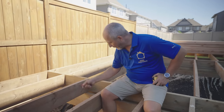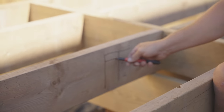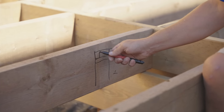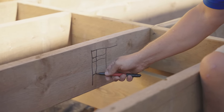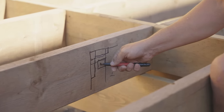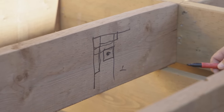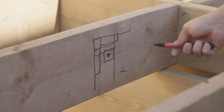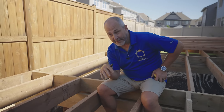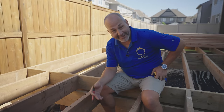So I'm going to show you the plan for the deck. Here's the corner — this is the box beam and here's our floor joist. When we're finished putting all of our boards on, I'm going to have an inside table here. I'm going to build in a custom eight-foot sofa on each side, and then we're putting a fire pit right here. My goal is to identify where this location is because I want to have my gas line come underneath the deck and come out of the deck right here. My gas guy said you need conduit, and inch and a half ABS works great.